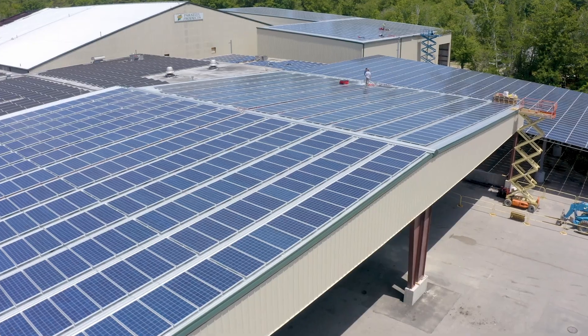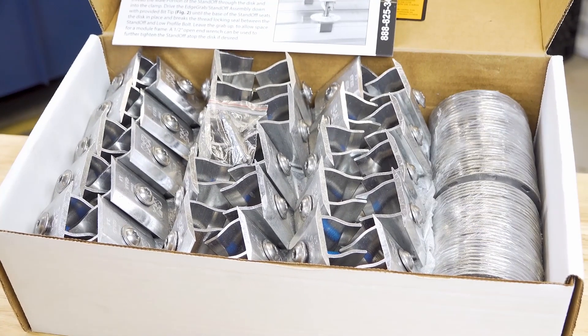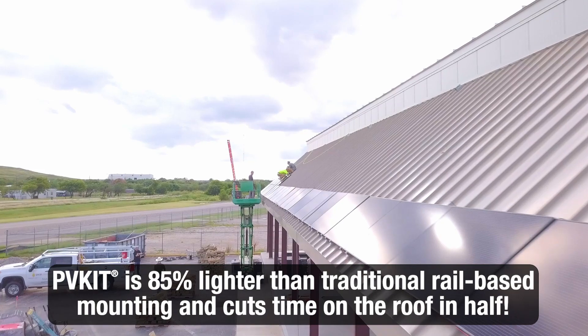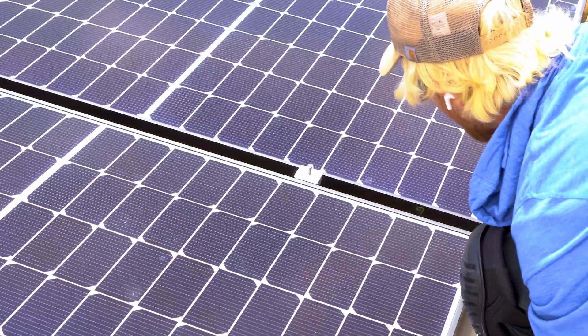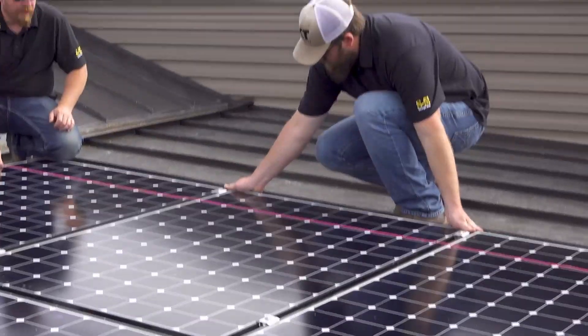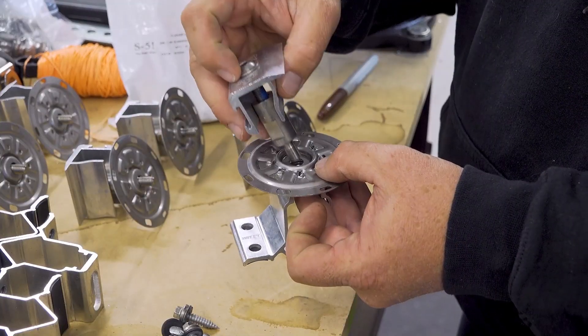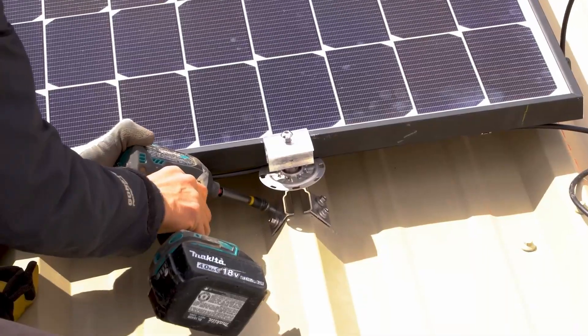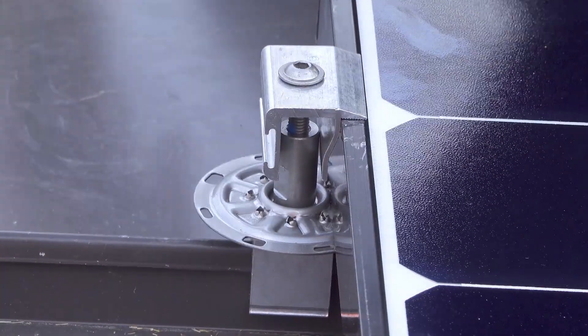It is different — people are used to rails. They know how to attach the MLPEs to the rails and zip-tie the wires to the rail as they build out their row of modules. With PVKit, it is important to attach your MLPEs to the module frame whenever possible. You can also attach them to the roof and put them underneath the modules. If you take a few extra minutes ahead of time to know where your strings are going to lie and how your MLPEs are going to attach to the modules, and before you bring your modules up on the roof have someone clipping wires up to the module frame so you don't have lots of dangling wires — it really is just a matter of putting the module into place, clipping up your conductor wires, and securing the module, and you're done.